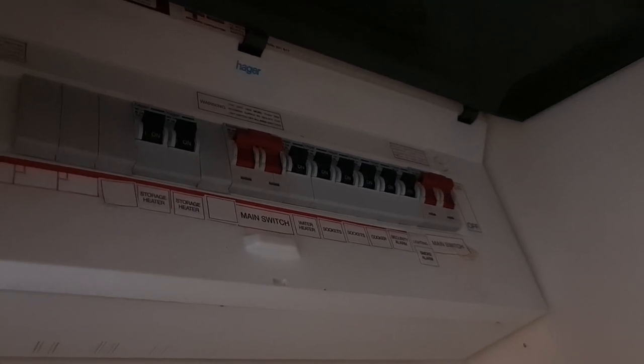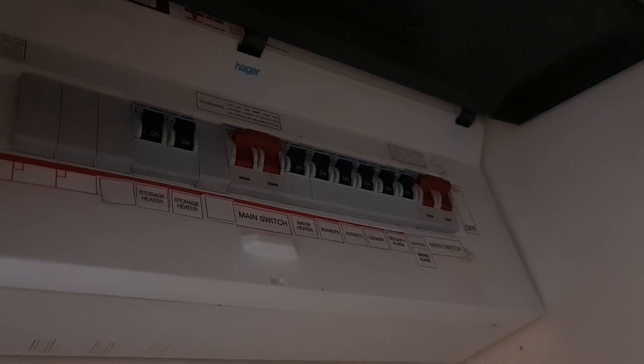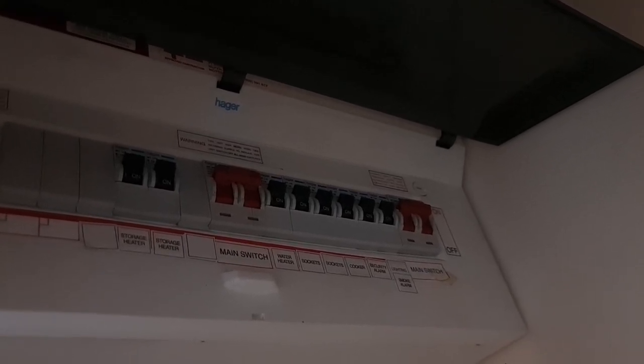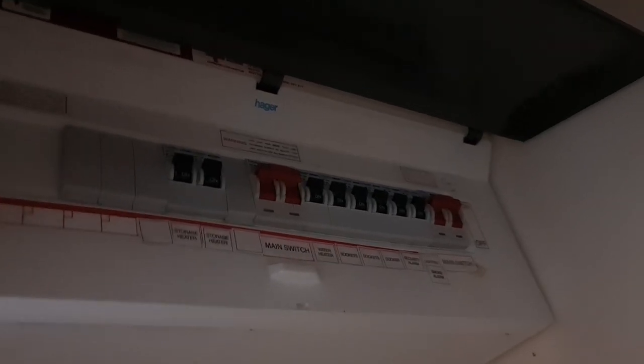And the EICR on this property has actually come out fine. Just a couple of little snags. There's a heater in the bedroom that was a bit iffy, and that was to do with a fuse connection point that's needed repair, and also the water heater element where I think they've just got a bit fuddled up with how they've been trying to use it. But we have actually identified that there's a potential there for some earth leakage problem that's building up for the future. So that's good to make the letting agents aware of.